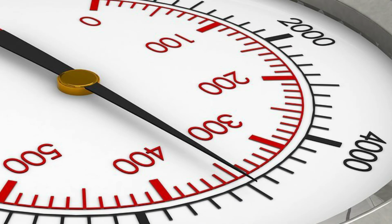To check the amount of gas in the bottle, connect the regulator and the PSI will display the volume of how much gas is left. For example, if you get a reading of 100 psi and it's a large bottle, say it holds 1200 psi, then your bottle is almost empty.